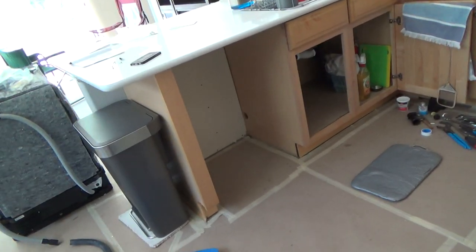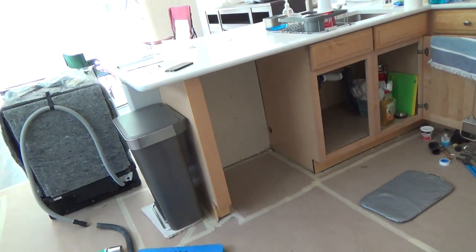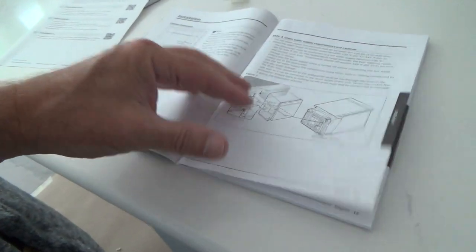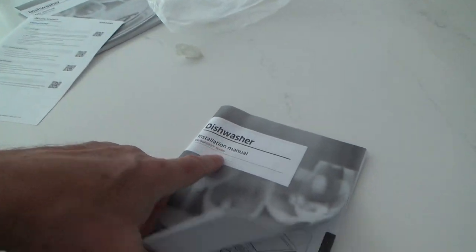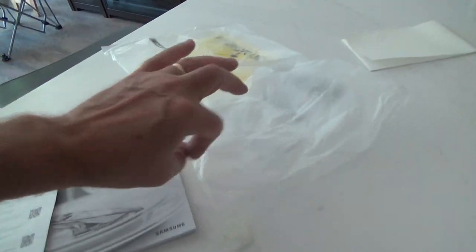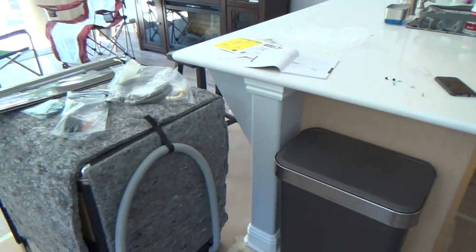If you don't remove the cap and you run the dishwasher for the first time, you'll have water going everywhere — that's happened to me twice. Years ago, about 30-some years ago when I first started in construction, we had everything hooked up, were proud of ourselves, and left. A couple days later the customer called saying there was a leak all over the place. We finally figured out we hadn't knocked out the cap. Read the directions on your garbage disposal installation — it'll tell you to knock that out. Save all your manuals and documentation. Better safe than sorry.